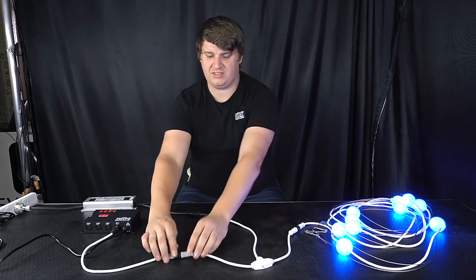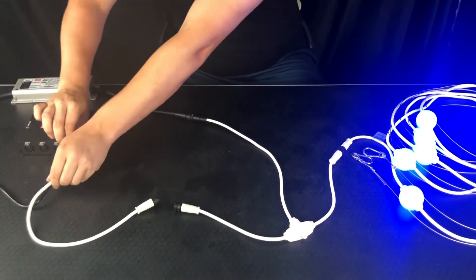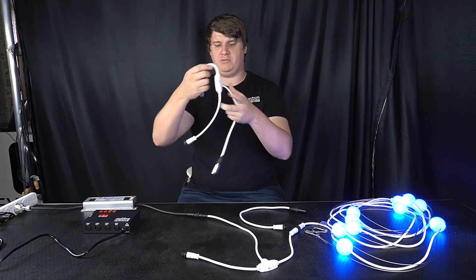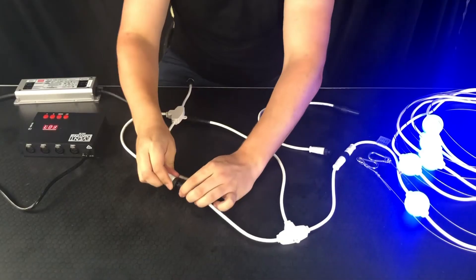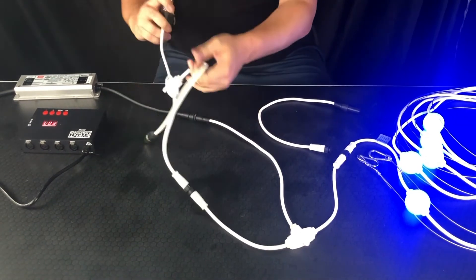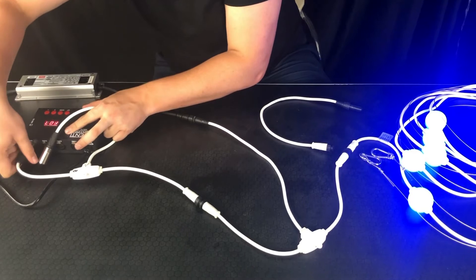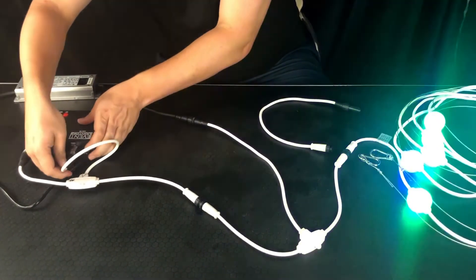Now that I've shown you how to set up the PixBalls, I'm going to show you how to set the DMX address for them. The first thing I'm going to do is disconnect the DMX input from the PixBalls and the controller. Then I'm going to use this custom cable which has got two DMX connectors — going into the PixBalls, and this is important: label B goes into universe 4 and A goes into universe 1.